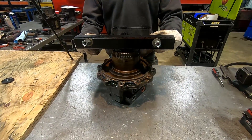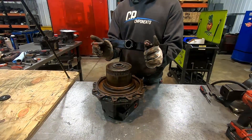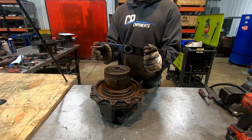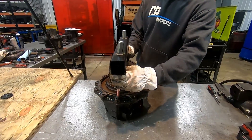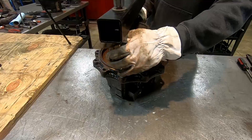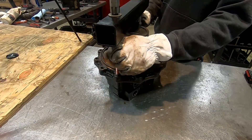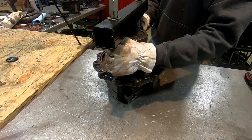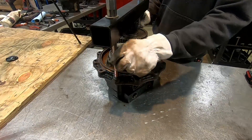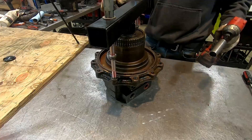You can use one of these very basic tools — this is an M14 bolt and we're just going to screw them right onto the housing. If this is still on the machine you won't have access to these bolts, but you can screw them into the holes where your sprocket bolts go.